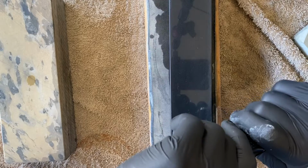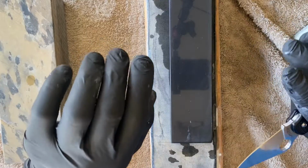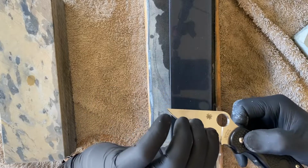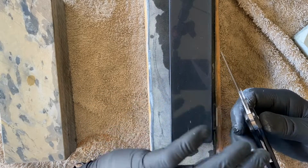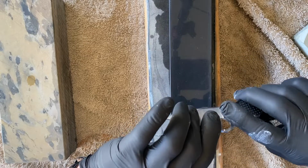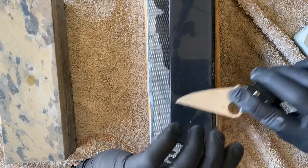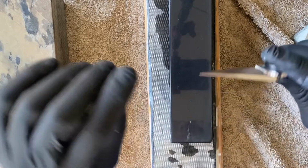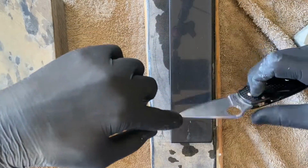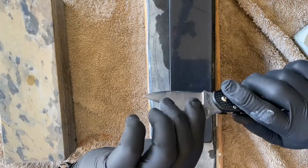Bread knifing and jointing. So bread knifing is, you'll see in the industry, some of the people use the term, I killed the edge, and all they did was they pull the edge across the stone, which at a microscopic level just flattens the apex, and then they put it back. You're not going to learn that way because the bevel's already polished. It's something I do not recommend doing. Rather lift the spine off, do it on a coarse stone by hand like you would with a knife, and set part of the bevel, and then do the rest of your honing.